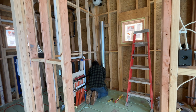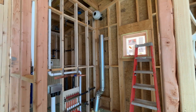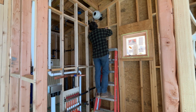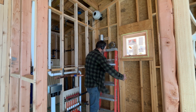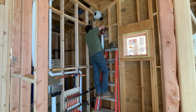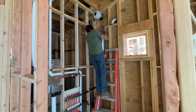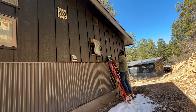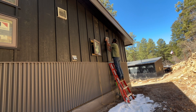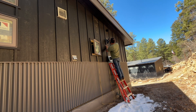This metal pipe — I'm wrapping all the joints with metal tape, and that seems to work pretty good. Then I'm going to insulate these pipes afterwards with some wrapped insulation. Here I'm trying to figure out where to cut the hole through the side. The reason I chose this side to be the exit side is it was really the only spot to get a pipe out in this area. The other pipes going out up in this area — you can see one above my head — that's a radon. There's a hole up there that a pipe is going to come down through, and I'm going to be pushing out air from that. So you can see I'm about 10 feet away from the air coming into the house.